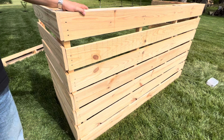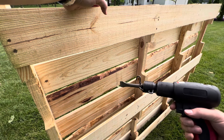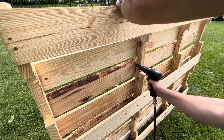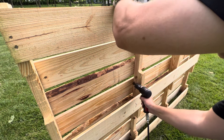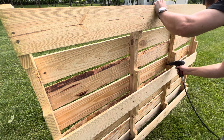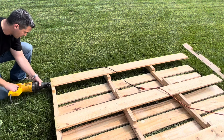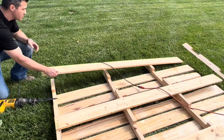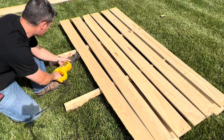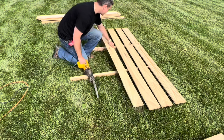The front and sides are complete and it's time to work on the top and shelves for the inside of the bar. I grabbed a third pallet and an air hammer, using another technique for the stubborn deck boards attached to the middle stringers. I found this was a lot less labor intensive and more efficient than the two by fours and hammering by hand to create the gaps. Since the bottom of the boards will never be seen, it doesn't matter if there are some small marks, and the air hammer makes quick work. I was more than content with the gap as it gave plenty of access for the reciprocating saw to cleanly and quickly remove the boards. I still use the same process for removing the boards from each end stringer. Now instead of struggling with the middle stringers, using the air hammer to create the gap saved a ton of time. This is enough lumber to complete the top of the bar, all the shelves, and to have plenty extra for a future project.